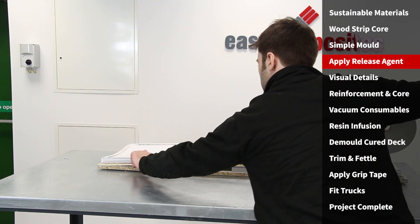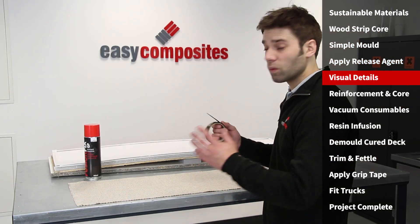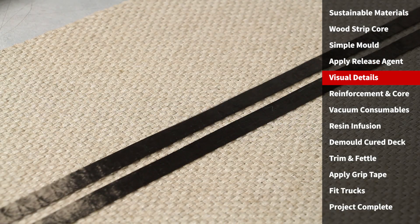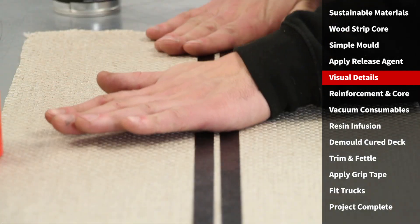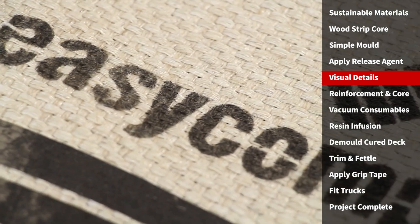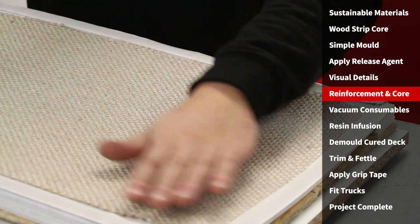Before starting the layup it is good practice to apply the vacuum bag and gum tape to the mold. This ensures there are no stray fibers under the tape that would compromise the seal. We want this board to look really cool, so we're going to detail the flax with some unidirectional carbon fiber and then stencil our name and graphic onto the fabric directly with spray paint. A very light application of FusionFix is all that's required to secure the spread tow ribbon in place. The stenciling is done with a simple paper template and standard acrylic spray paint — this gives the potato sack look I was after. Of course, here's where your imagination is the only limit. So that's going to be the first layer of reinforcement into the mold.